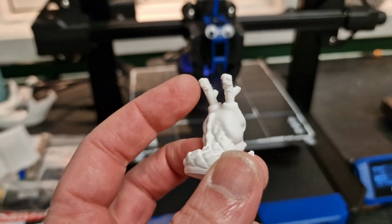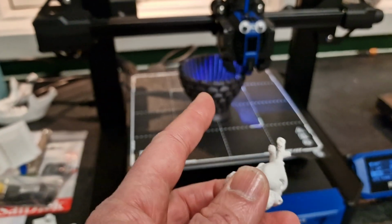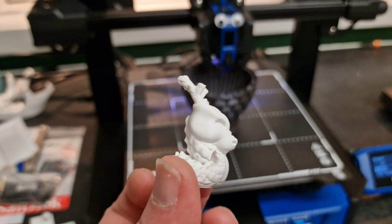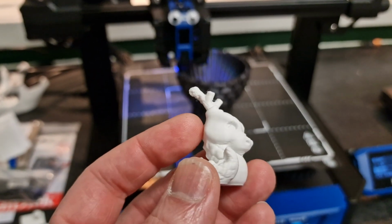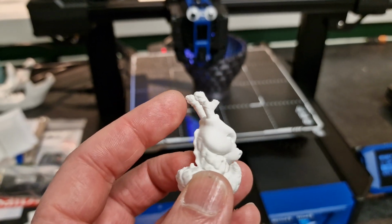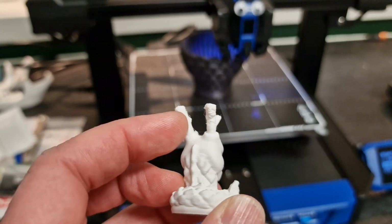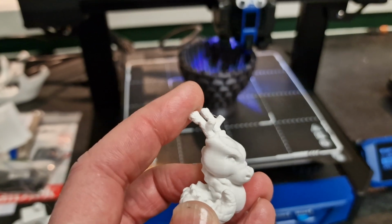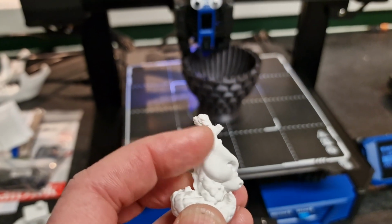it looks. But the horns here, because I had to print at a little bit higher temperature, the cooling at that speed, I forget what speed I was printing. I think this was at 80 millimeters per second, just to test to see how fast I can get it going. So with having to bump up the heat to compensate, the cooling shows that obviously that's what these bad areas in the background are, because it was too hot and not cooling down fast enough, so it starts curling upward. That's what caused that messing there.